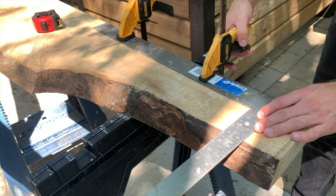After pouring the epoxy, wait around two to three days to let it set up before removing the melamine forms. I removed all the bar clamps, then removed the screws and tried to pry the forms away. Sometimes this is easy, but other times the epoxy has bonded to the form and it's a pain to chip off. If I were doing this again, I would apply Tyvek tape to the entire form because no matter how much I tried to seal it, some epoxy seeped around and really bonded to the bottom of the form.